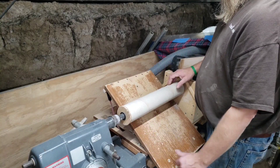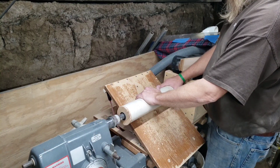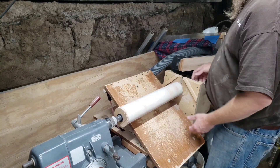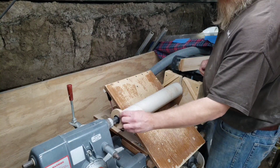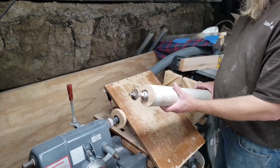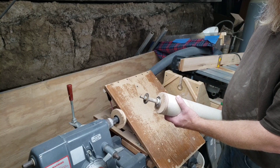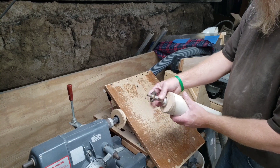The first thing I really need to do is release the quill on my Shop Smith. That's really what's holding the drum together and putting pressure on my tail stock over here. What you've seen is that quill starting to release — I'll just pop it out. Plywood homemade hub right there on one end, and on the other end what you've seen is a very noisy bicycle hub. Obviously it needs a little lube. I think maybe I'll put a little grease fitting in there. It's nice and tight — it hasn't exploded.